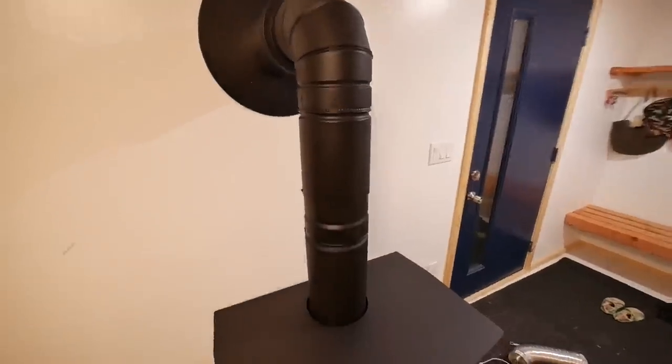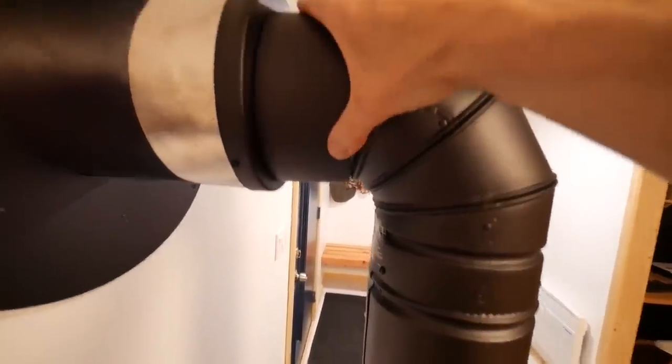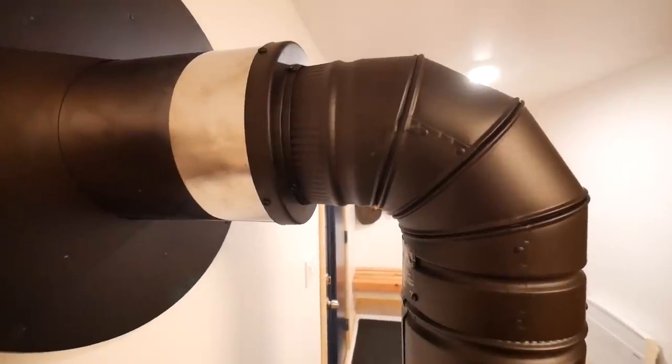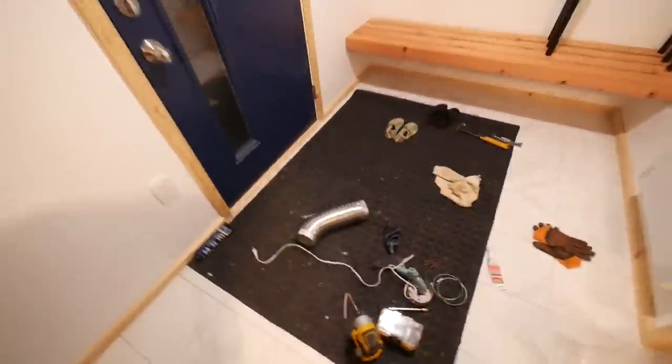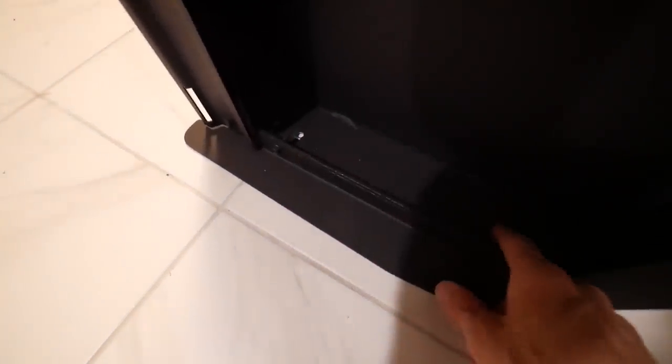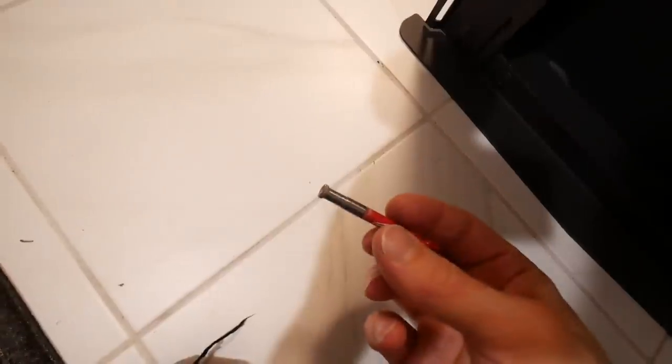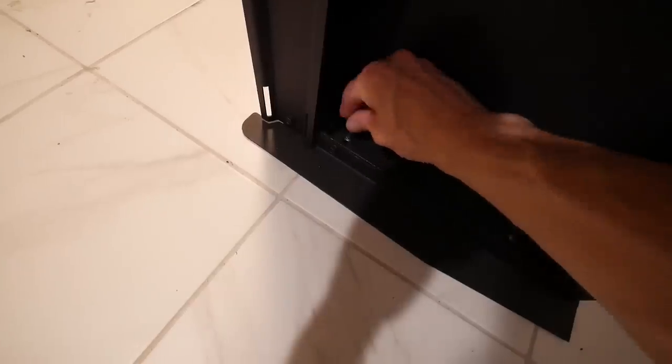We're making progress — I think I got it all secured. There's a decorative part meant to go around this section to hide those ribs, but it doesn't really bother me so we'll think about that later. On the sides of the wood stove there are holes for mounting it to the floor to keep it stable — that's required for mobile home installation so it never shifts and dislodges the air intake or pipes. I'll use a diamond drill bit to drill holes in the tile and screw it down.